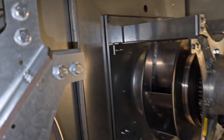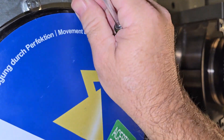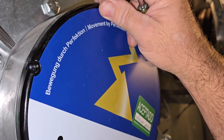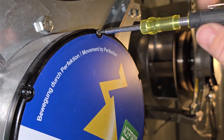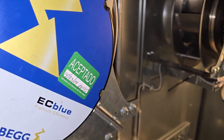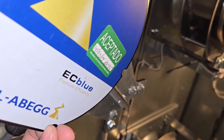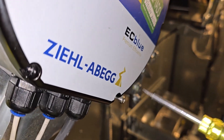So the factory setting did not have it enabled to run off of this, which they call E-1 — that's your voltage input, analog input. I think I was looking for a signal through my bus, which would come from an interpreter to BACnet. So they were not set up for that. I finally got their software connected and figured out how to get into that setting. Changed it on a hunch — I was waiting for people to call me back with some info, but I got it figured out.